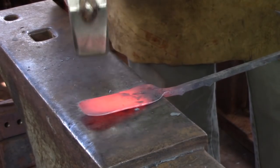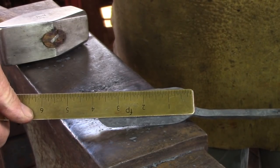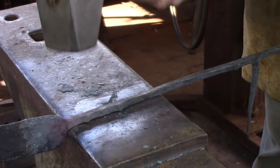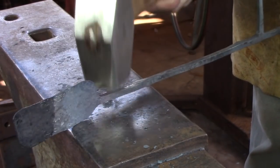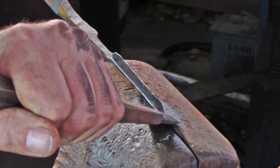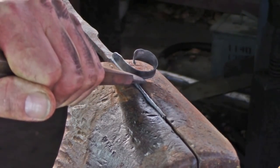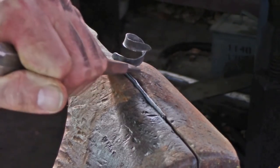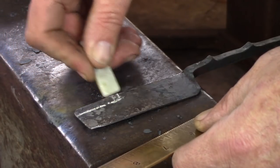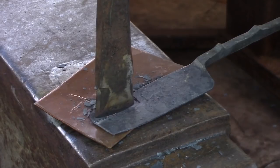Dress the forged material with the flat face of your hammer and then check for an equal spread — you want about one inch of material above the base line. Make sure the candle holder material is parallel to the center line of the bar as you work. Identify all the material below the base line, snap a chalk mark, then go to the vise and use your hot-cut chisel to cut off the excess material. Hold the chisel at a slight angle so the chamfer on the bottom of the chisel is parallel to the top of the vise. The candle holder is comprised of two parts: the bit that will actually hold the candle, and a thumber to open up the cup so you can get the candle in place. The thumber is going to come to rest above the eye material and needs a section of the flag removed to allow it to fit.